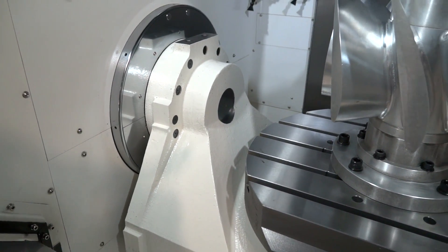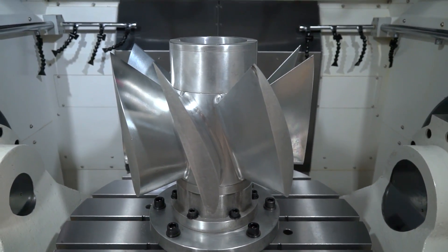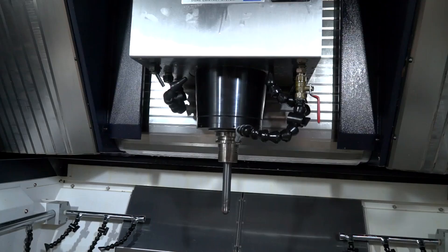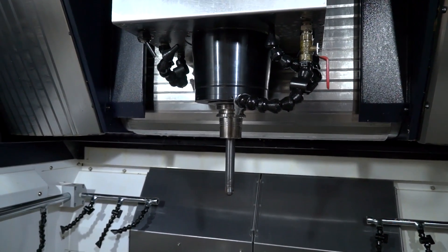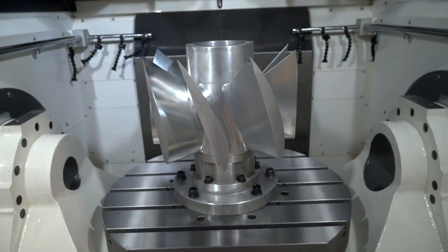So we've discovered that they've put a lot of time and effort into making this a highly accurate machine. It's quite a fast machine as well, isn't it? Yes — by default in the standard we have 20,000 rpm, and the spindle can also be extended to 24,000. We have a very fast moving machine with 48 metres per minute rapid speed.